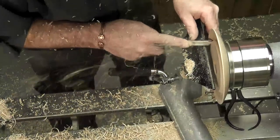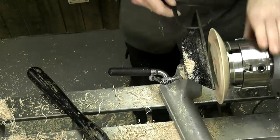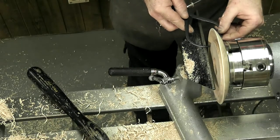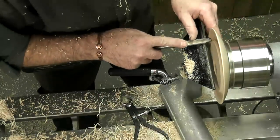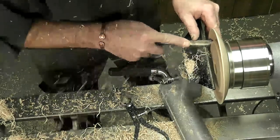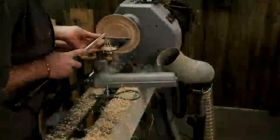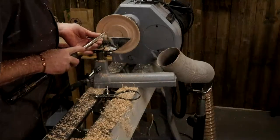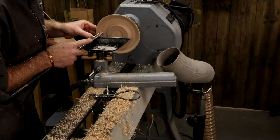Okay, I'll cut. Bring it round. Have a quick look. Check our gap there. I can wind them in a little bit if you've got a big gap there. Okay. Still getting that a little bit thicker. So we rub the bevel gently, raise the handle, we find our cut. That looks good. So knock some bulk out. Getting down to where we need to be.